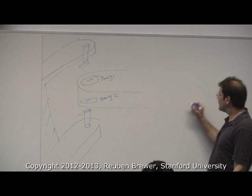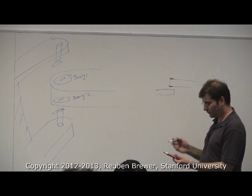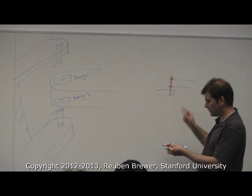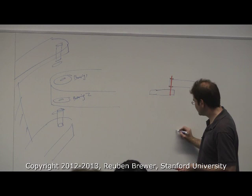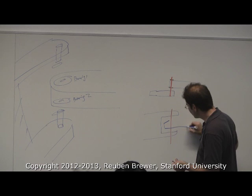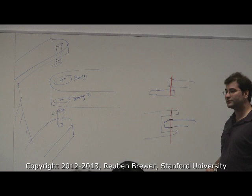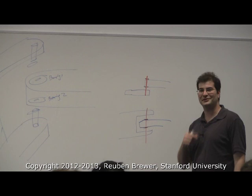Okay, if I have two joints, this is one link, and this is the second link. And then this is one bearing, and this is the second bearing. And then this is my shaft. Okay? Which is stronger, this or doing... Assume all the dimensions are the same. So, same link, same two bearings, same link, same two bearings. Which is stronger, this one or this one? This one. I said this twice. Thank you. Top or bottom? Bottom. Bottom. Okay, so this is the good one.